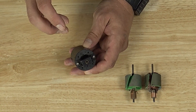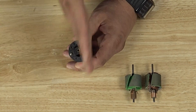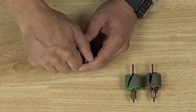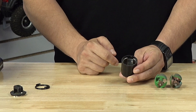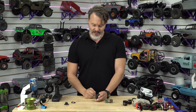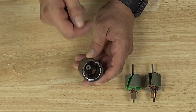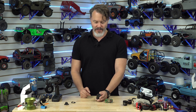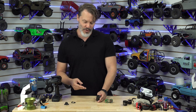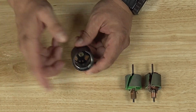We had these multiple parts that kept the magnets spaced and centered, and then we had that t-bar installed with the motor. I call it a t-bar because it was shaped like a T. You couldn't have it stay in the motor for too long — these magnets are so strong. If you didn't pull that t-bar out in time, it would end up fusing itself into the motor, and both your jig and the magnet and the motor would all be ruined. So I had to find that perfect window when the two-part epoxy wasn't quite set but set enough to yank the jig out. A huge hassle, but it worked — it worked really well.